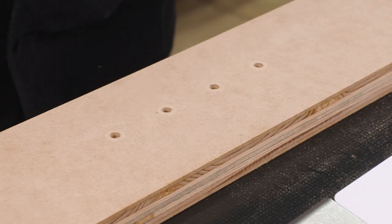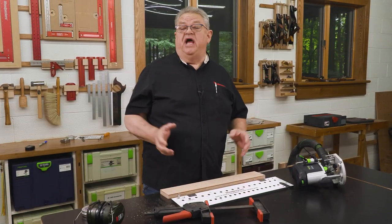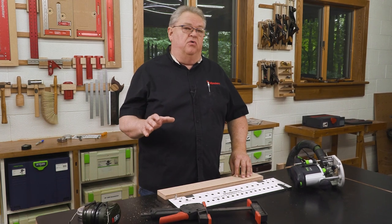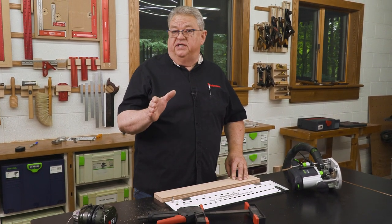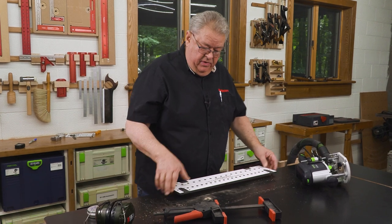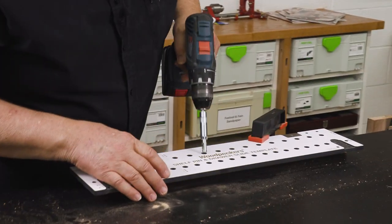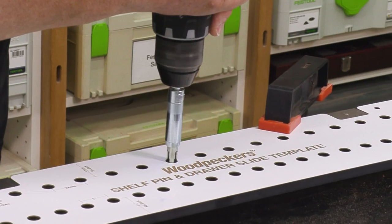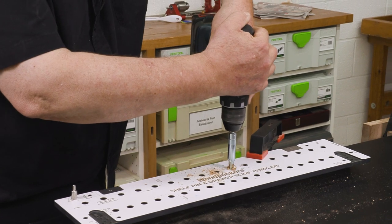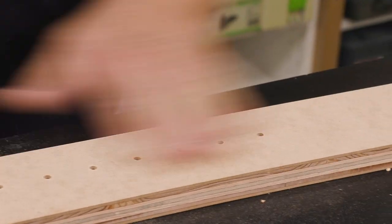Let's take a look — a perfect fit on our shelf pins. That's the way I prefer to drill these holes, using the router. But just so you have an idea of the difference in workflow, I'm going to drill a couple with the self-centering drill bit as well. Everything else is the same — lined up the same, still clamped down. We drop that in the hole and punch it through, and those holes are just as nice.